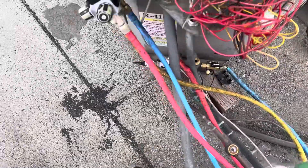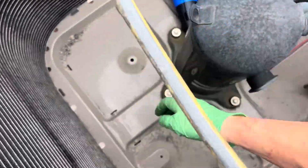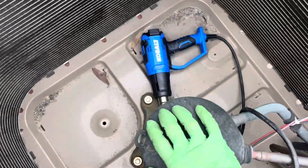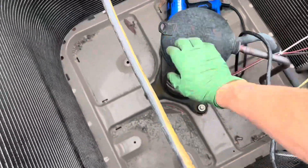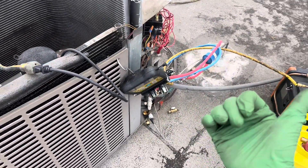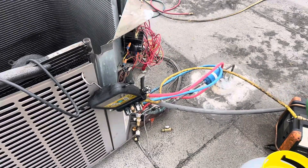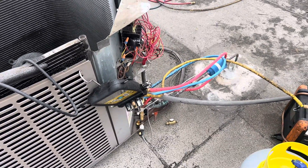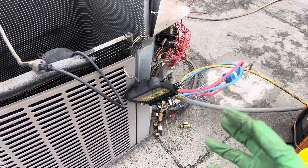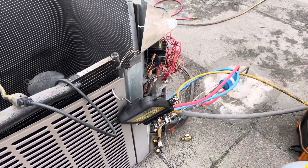Get the other side now. You can see I have the heater going on there so it doesn't freeze up and slow down my recovery. My son went downstairs and turned on the air handler because inside the room it's about 85 degrees, so I'm blowing hot air over the evaporator coil. So while I do my pull down, it'll speed up the job of my pull down.